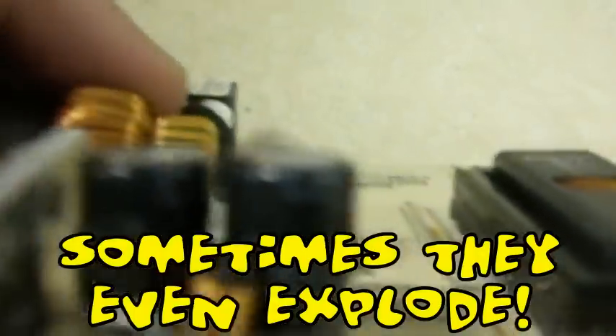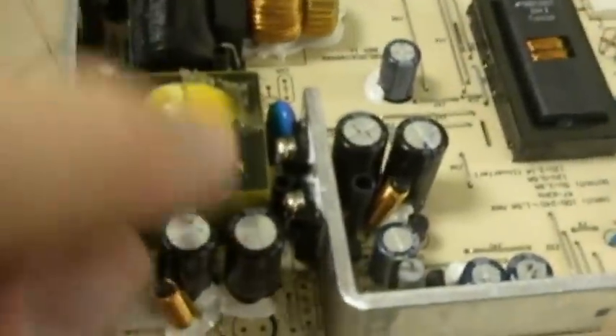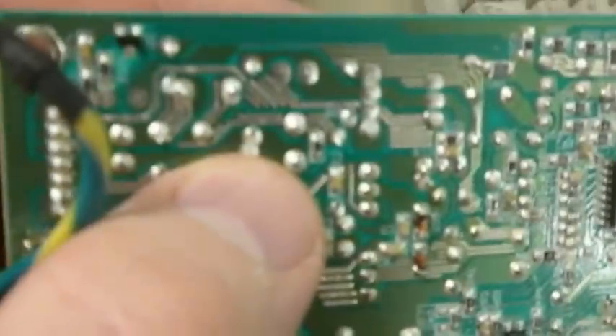You can see these other ones here are flat. You can't always go by that, but most of the time when they're flat they're still good, and when they're bulging out, they're dead. You have to use your trusty soldering iron, go up underneath, and remove them by delicately unsoldering them from the board.